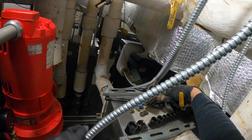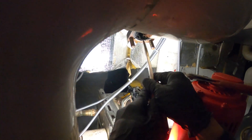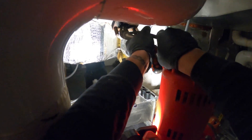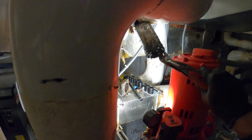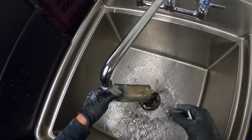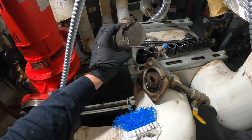By the looks of that I can tell this thing's gonna be nasty. It's hot too — yeah, there's a lot of stuff in there. Let me get a flathead and a pair of channel locks. They don't do any maintenance here, so who knows when this strainer was last pulled. Okay, there we go — it's pretty dirty but it ain't the worst, really. Just going to clean this off in a slop sink, brush it out. The strainer is nice and clean, you can see right through it.